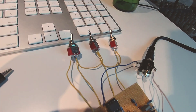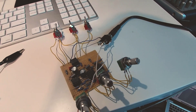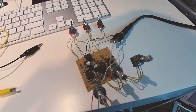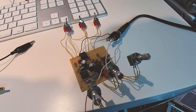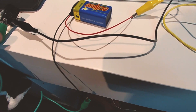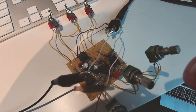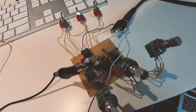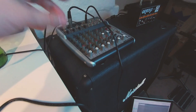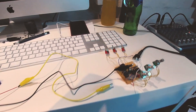I had to figure out how to wire it up. As someone who doesn't know loads about wiring stuff up, it was a little bit tricky, and I thought it would be a trial and error job. But I've been quite successful — it worked first time. I've just got it hooked up to a nine-volt battery at the moment, and I've also crudely put on an on/off switch with crocodile clips as I'm prototyping. I've got it hooked up to my mixer via a quarter-inch jack, which is USB into my laptop and then to some speakers.